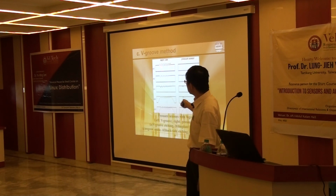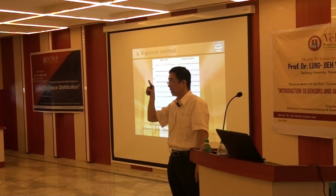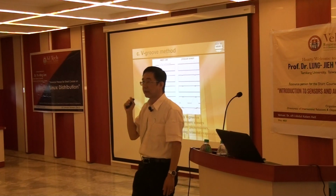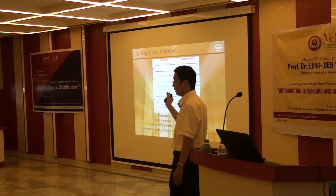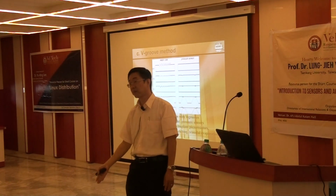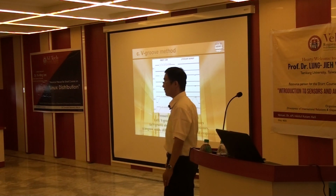The idea is I machine many big grooves, but with different widths and different depths. Yesterday I mentioned the width and depth have a relationship, the square root of 2, about 1.414, a fixed ratio. So if we design our photo mask with this dimension for the open window, and open the oxide, then dip this wafer in the KOH, firstly not the final etch, only the first test etching.